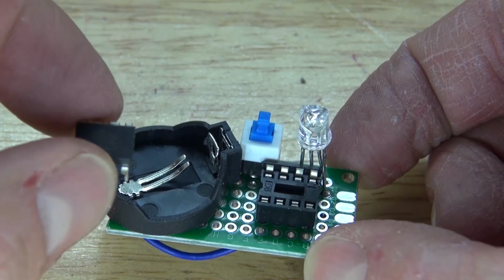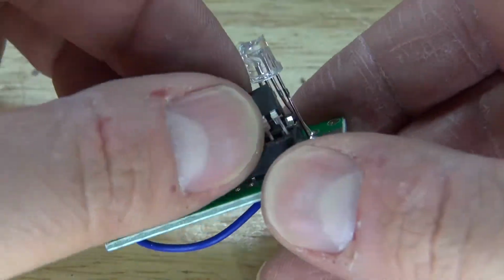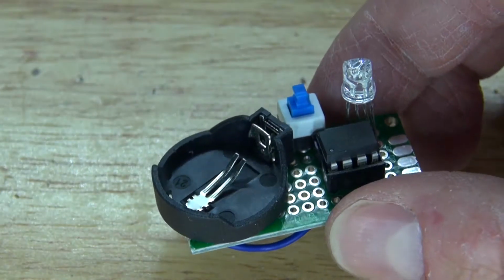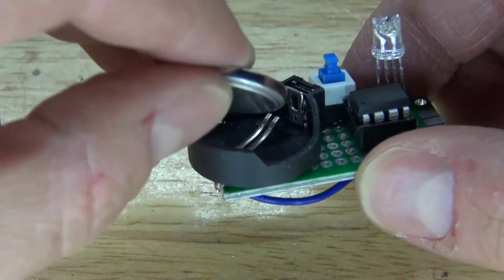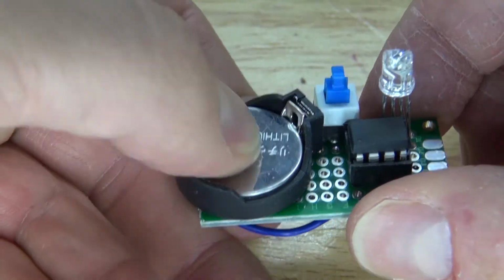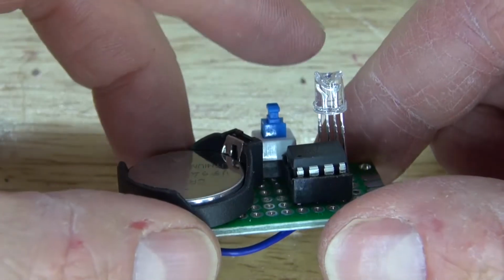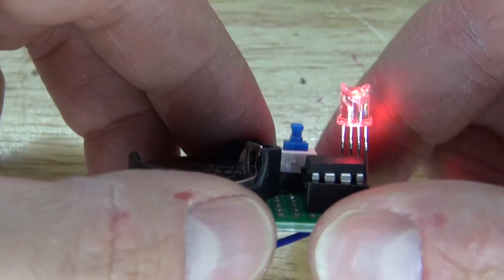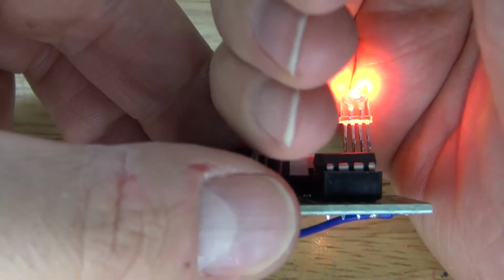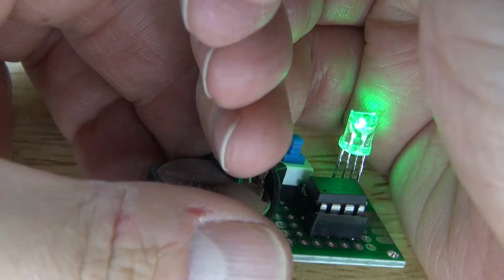And now, take the Attiny85 microcontroller and place it into the IC socket holder. And now connect the 3-volt button cell battery. And there, the circuit is now complete. Now, let's go test it out. And there, it works. And down in the description below, I have the code to the Attiny85 microcontroller, so that way you can make the RGB LED glow like this.